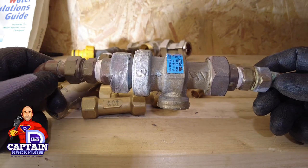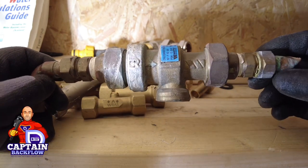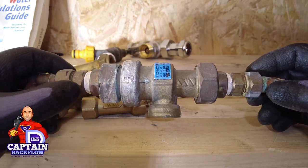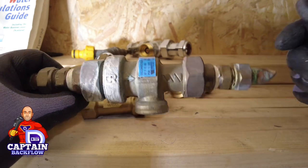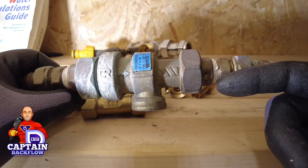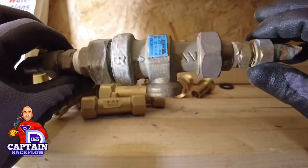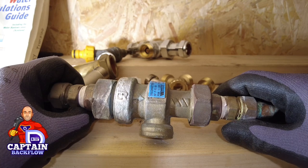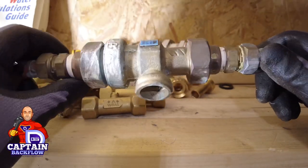This is known as a CA device — a non-verifiable backflow preventer, sometimes also called a disconnector. These are found built into some modern boilers. When you turn off the number two isolation valve, you get a little water dribbling out of the port. I'm not a fan of them because you have central heating water at high pressure and temperature pushing on the back of the check, and I think that's often why these fail — water then passes the check and starts dribbling out.